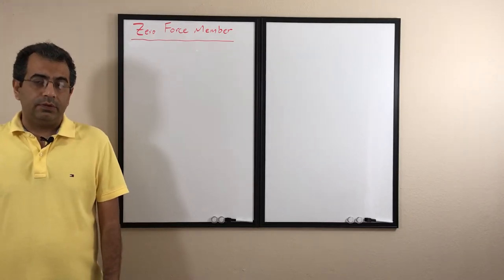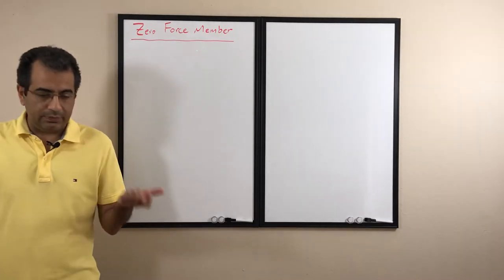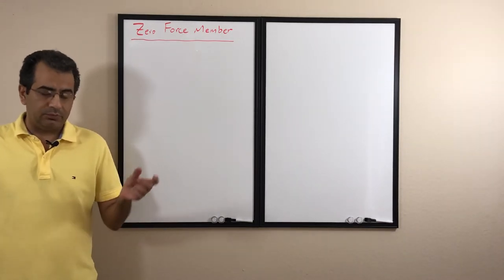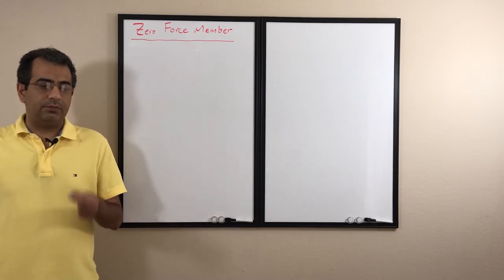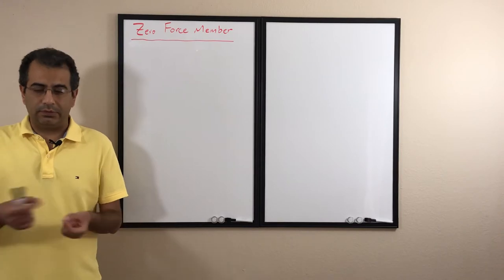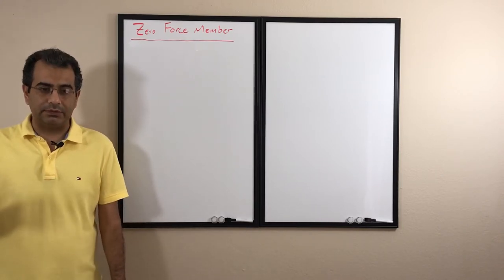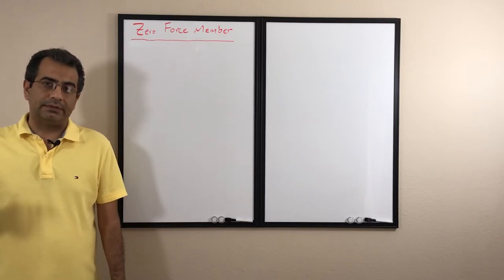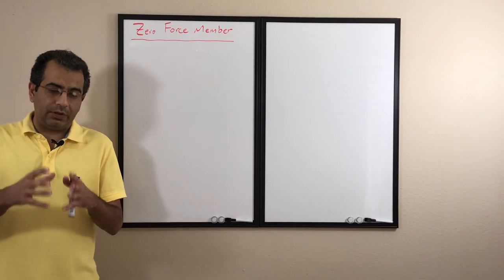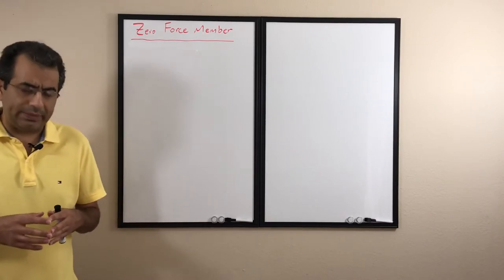Hi, today I'm going to start to talk about the zero force member. Whenever we have a truss and we start to analyze that truss, at some point during the analysis, we will find that some of the members have no force in them. In other words, when we calculate the internal force in those members, the internal force comes out as zero.